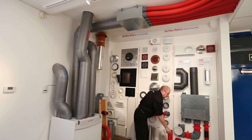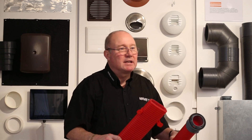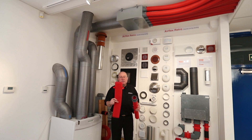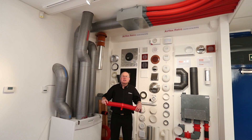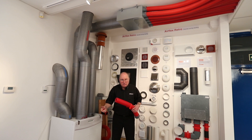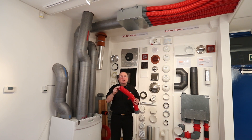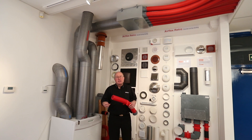We also have an oval section pipework. This is narrow section, 51mm. The round is 75mm diameter. If you've got a low profile section to get into, this is ideal. The ductwork is classed as semi-rigid, which means you can bend it very easily. With the smooth bore, bending it does not increase any system pressures — they stay the same. The system pressure through the oval is exactly the same as through the round, so chopping and changing between the two profiles of ducting doesn't cause any problems.